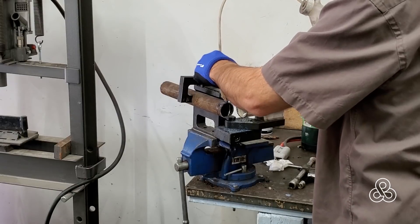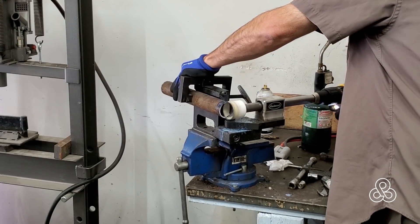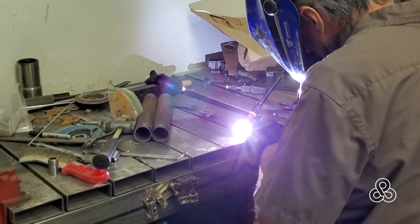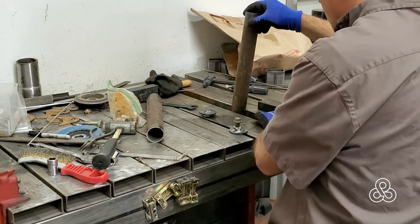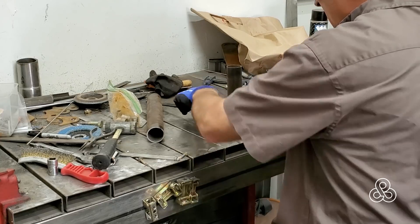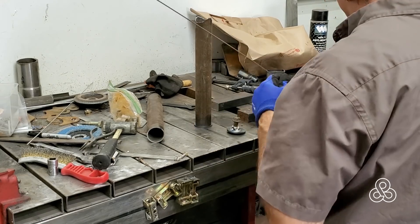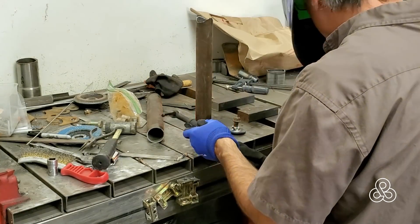The other end of the bracket is going to be these tubes. One of the tubes is going to be seated against one of the main cross tubes on the subframe, so we're going to take a hole saw and notch it out to fit on that subframe. The other end is going to be exposed to accept some sheet metal for the rear crash structure. I've got some round discs that I'm going to weld some nuts to, to create captured nuts on the end of that tube where the bolting will take place. I'm setting this up to weld those caps on, then I decided to flip it upside down — it'll be a little bit easier that way. Tack weld it and go ahead and weld those end caps in place, the end caps with a captured nut on the backside.